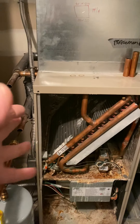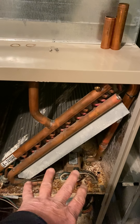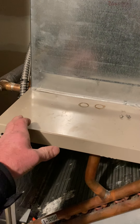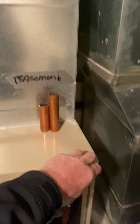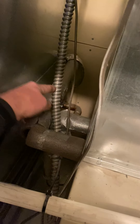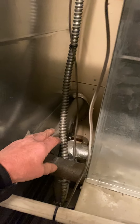I ordered a bunch of copper fittings and things, but our new units do not come with pumps, so I will order two pumps with three-quarter inch flanges. We have our water out and our water in, so I figure put our pump probably right here, come in here, and the other one just tap back into our water line. I just cut these off and put a coupling in and a 90 — our out connection, pump right here to our out, our in.